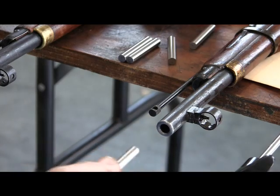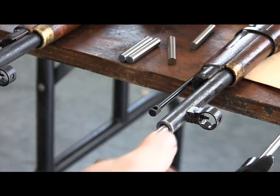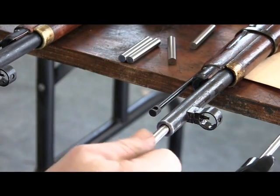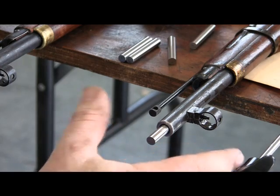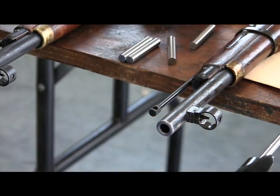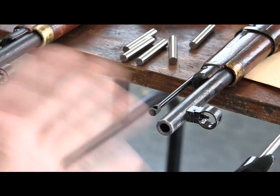There are armor tools. When these guns are re-arsenaled, they probably run a long precision-ground rod down these barrels to check that they're to spec. Basically, if you get the bigger rod going in, it means the barrel's worn out, it's no good. There is a specification — we're looking mainly at about 2 or 3 thousandths, not more than 5.